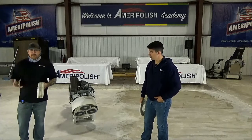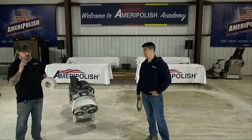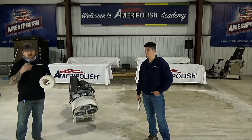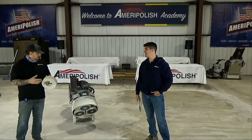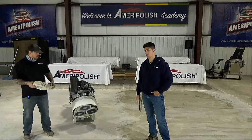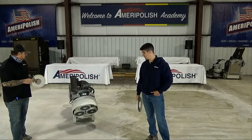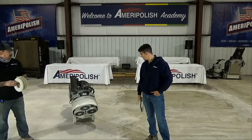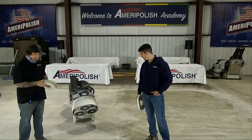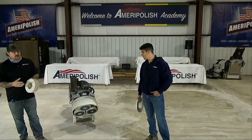There's different ways, guys. I'm going to be doing the S method, where you go down, turn around, come back, kind of a snake. There are guys that do the push down and pull back. What I mean by the leading edge is, add a little bit of water to the front if you're pushing forward. If you're pulling it back, add a little bit of water to the back. With this machine, the water unit's not working very well, so we're actually going to use a water hose on this application. And then we're going to go from there, overlapping it.